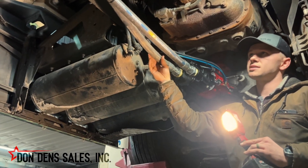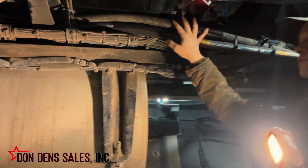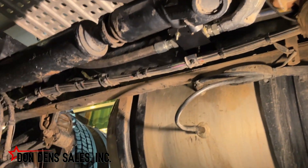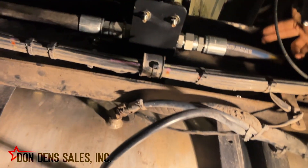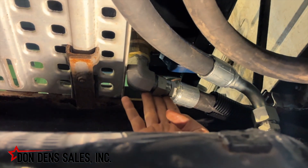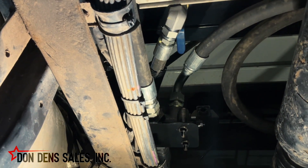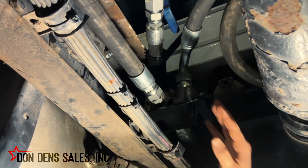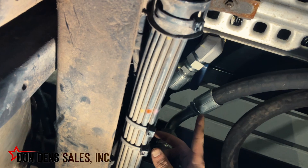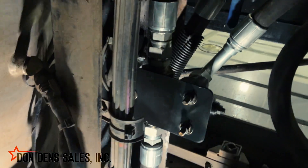We'll start on our suction line. Coming down the truck, there are various spots where we have loom tied up at any place that's rubbing. That top hydraulic line is your suction line and it runs to the bottom of our tank. Our tank is a top mount. Always run a ball valve on your tank just in case you have a leak somewhere upstream or downstream — you can shut that hydraulic supply off, disconnect fittings if you need to, fix the leak, and then reapply your hydraulic fluid. That suction line runs right down into your pump.